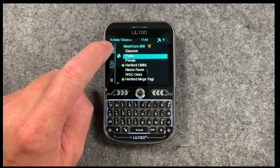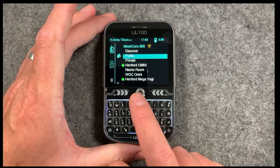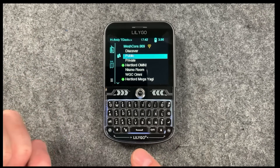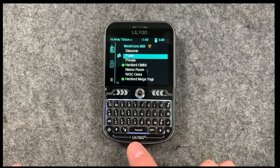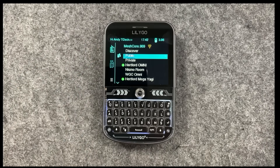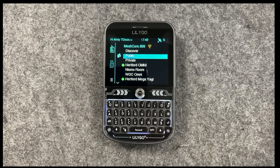There's a little green dot here that comes on and off over time. That's there to indicate not only a LoRa packet that comes in that we want to decode — it also indicates noise as well. If you're sitting there and you've got this big solid green light just flashing all the time, that is clearly not proper LoRa activity, that's just going to be noise. So that's a good thing to watch out for — if you see this on all the time, then there could be problems.